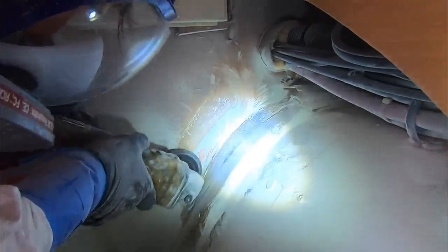Here we are in the starboard aft cabin at the engine room bulkhead on the aft end of the cabin. We've got delamination of the tabbing happening again — Jamie's just working on this one, taking the tabbing off a section of it, trying to get back to good glass. I'm working in here in the starboard aft cabin bathroom — the glue has come off the wall. I'm getting it out with the multi-tool and then grinding it so we can tab it with epoxy and glass. I've got most of it out already but that last little bit is just being a pain in the ass.